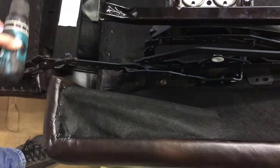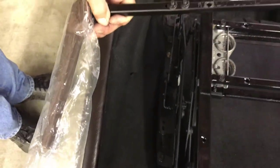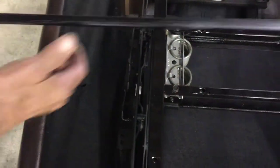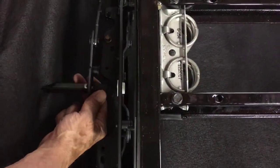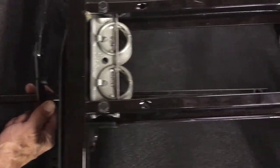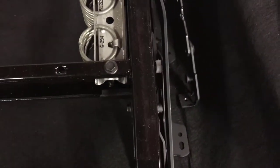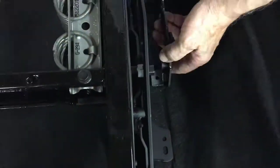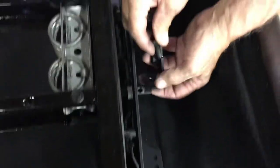I'm going to put the drive rod back in. The drive rod goes with the handle facing the back, with the footrest extended, and through this linkage, all the way through. And don't forget, these are the self-tapping screws.